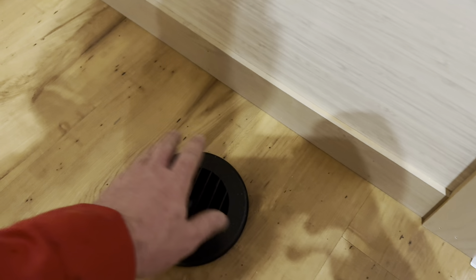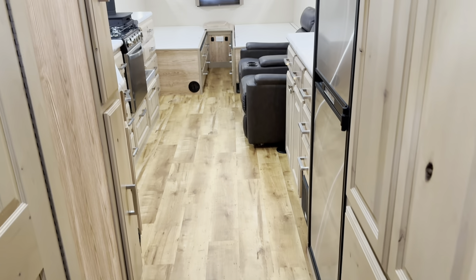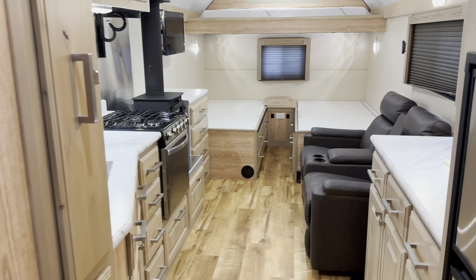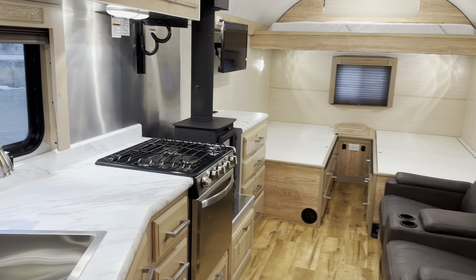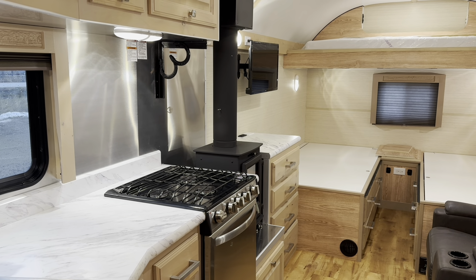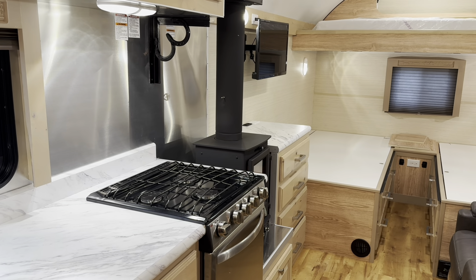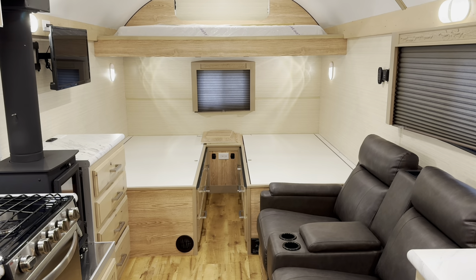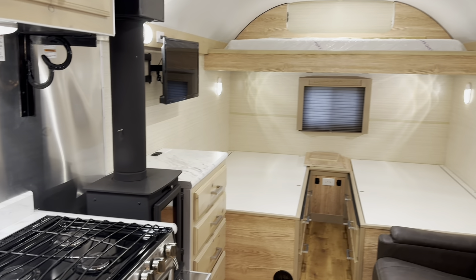We've installed a way to circulate air through the camp utilizing the heat from the wood stove. We're blowing through all of our vents now — circulating that warm air not only through the camp but also forcing air down into that tank enclosure to allow those tanks to stay warm. I think it's a game-changer. It makes the camp a lot more usable in the colder months, a lot less to worry about. Everybody loves the wood stove, but the downside is you can't circulate that heat — now we have a way that we can. You can turn that fan on, force air around, circulate it, and keep a more evenly distributed airflow.